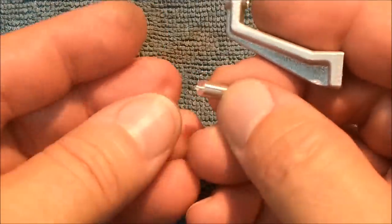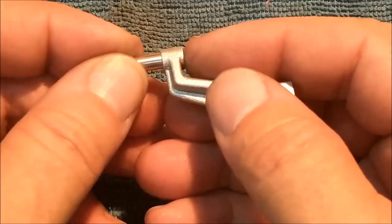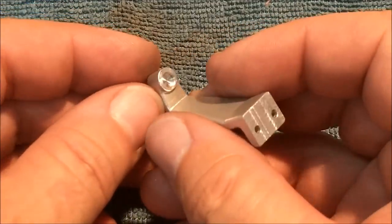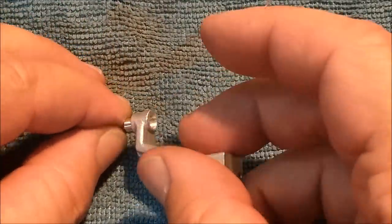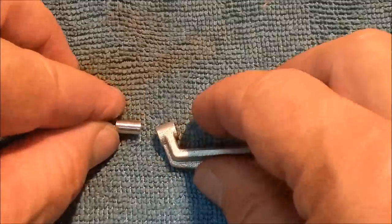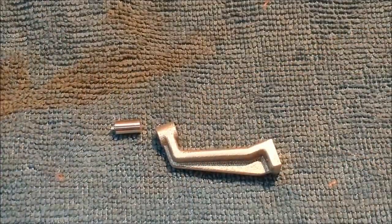This little plug was turned facing out. You can see the part off remnant on there. And I'm done with this. I want this to protrude equally out both sides. It is a very, very light line contact fit. It is extremely close to being size on size. And since this is aluminum and may transfer and pick up, gall, whatever you want to call it, cold fuse, weld, attract, I'm only going to do this one time.